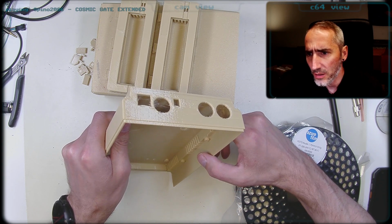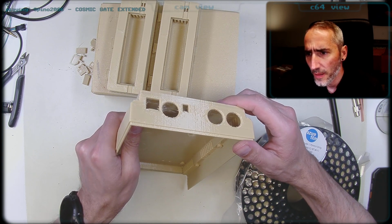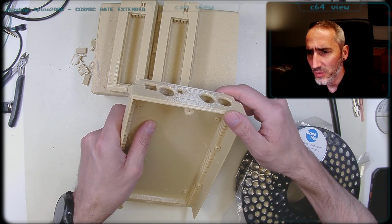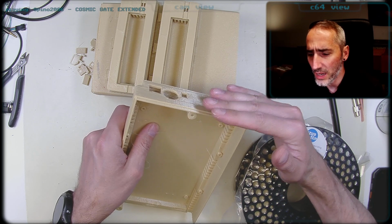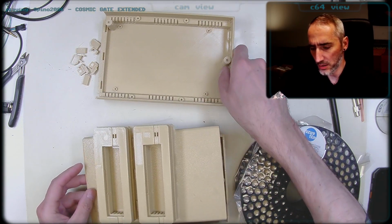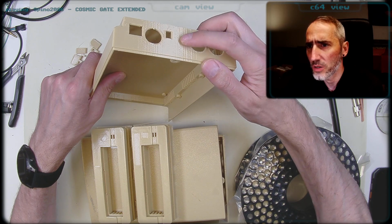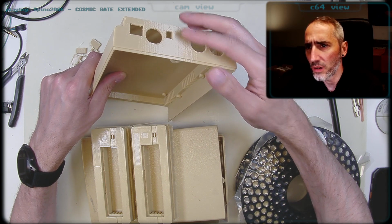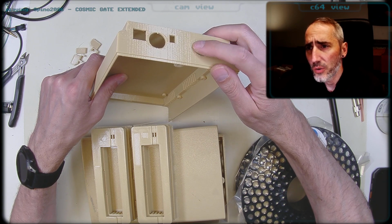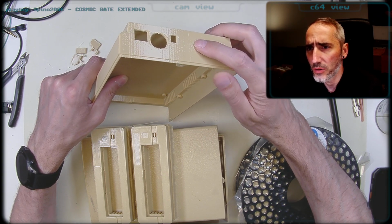And as you can see, the printer had really some sort of a hard time. Let me find an angle where this is actually visible. So this surface is not smooth. This is not just one surface. It has some variation in depth, so to say. And this is very interesting because this phenomenon isn't as visible here. Here it is almost invisible. So as you can see, this is really just one layer or something like this. There is some echoing around those round parts. So here you can see the printer had indeed some trouble to find back to the correct position.